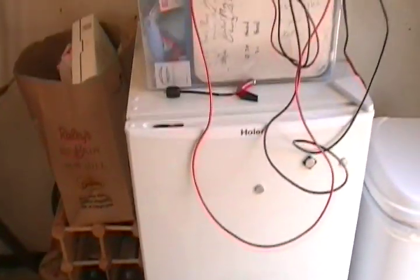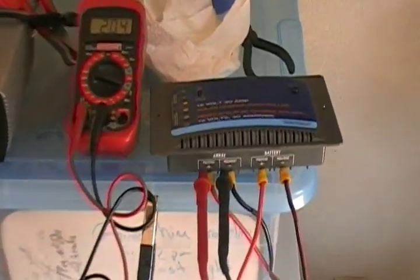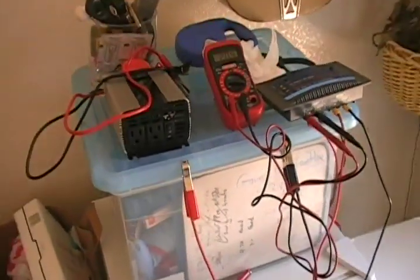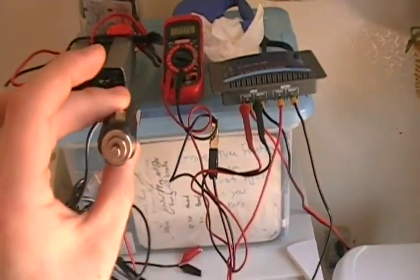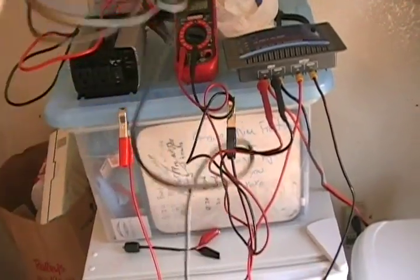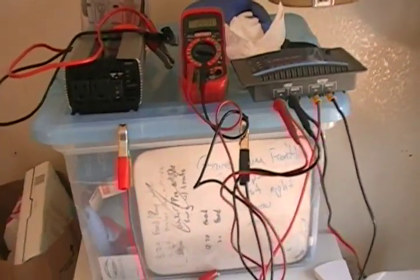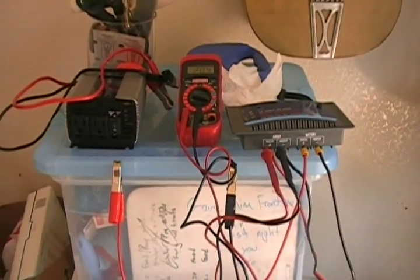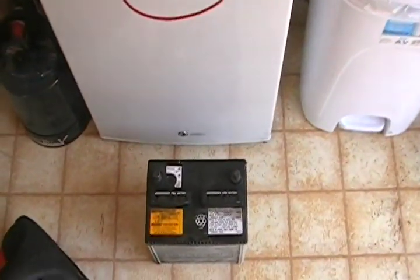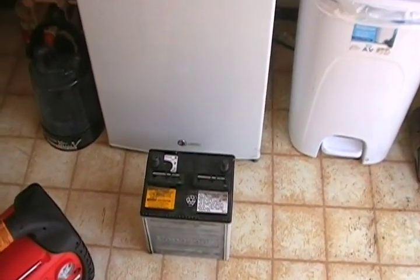I've got my power inverter and solar panel in there to charge that battery. They claim — I haven't been able to test it yet — but they claim I'll be able to connect this to my solar panel and charge it off the DC power, since it's got both DC and AC. It comes with a DC car adapter so you can charge it off your car battery. They recommend you have your car running. I'm testing it charging from the AC outlet and it's only pulling about 5 amps, so my solar panel won't be able to directly power this, but once I get my battery bank set up I should have absolutely no problem powering it off those batteries.